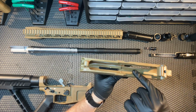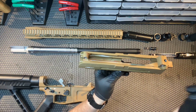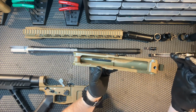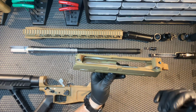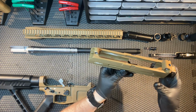Pretty much anything that you see wear, right? So metal on metal is what that means. That means there's a friction point there. That's going to be something that you want to grease. Anything bare metal should get some kind of lubrication, okay? Protect it from rusting. Or it's a high friction area and you're going to need that so it will function properly. So grease the channels, okay?